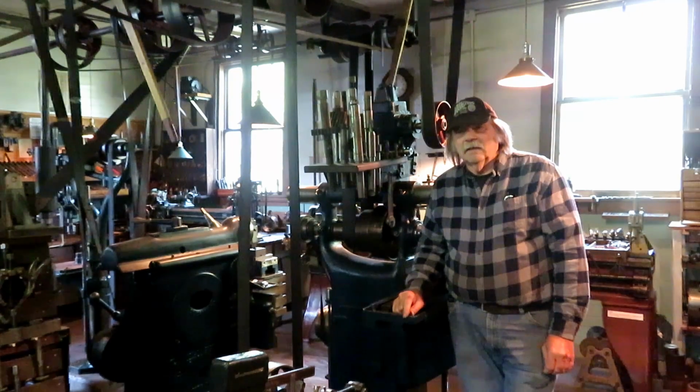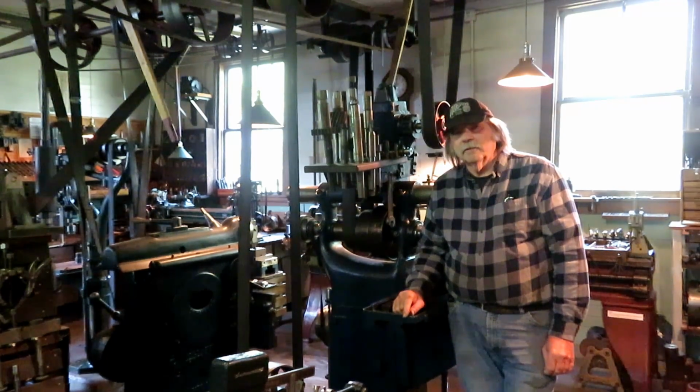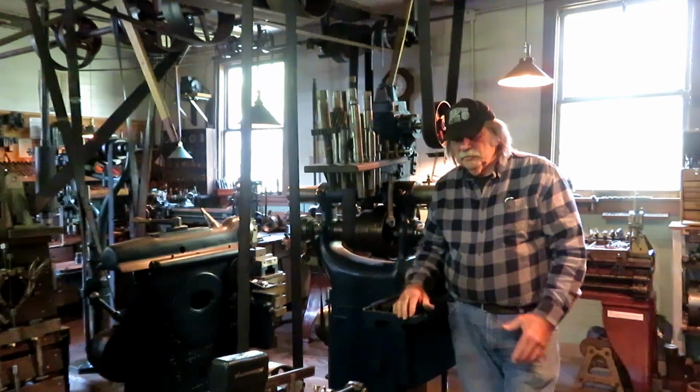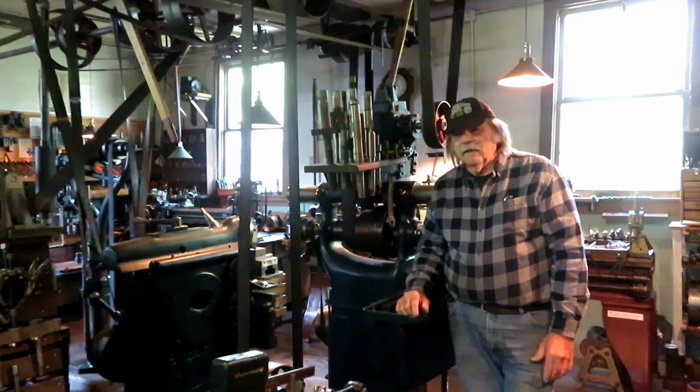Also had a customer with a small 1.5 horsepower hit and miss engine. It was an air-cooled engine, which is a little unusual. Most of those are water-cooled with a cast iron hopper to hold water around the cylinder. This is air-cooled, and it's a sleeve and bore job. I've done them before on this channel, but this has got a couple of little interesting twists to it.